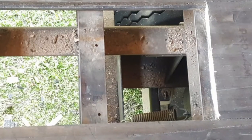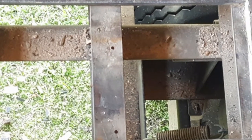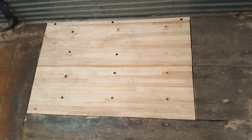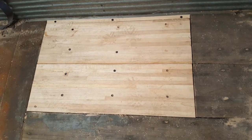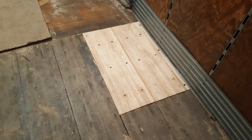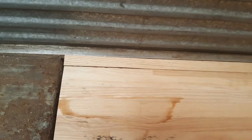Those front ones have a flat bar where I could shoot up the drill bit from the bottom and have the pilot hole for my bolt and use their same hole so I didn't have to drill through the front ones. But now, see, these back here, they have the H-frame. And the H-frame, you can't come in from the bottom because the bolts only go through the top of the frame. So I was able to put those right there in the front by pilot drilling through their same hole. And we were able to put the bolts in without having to drill through the metal.